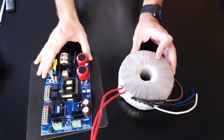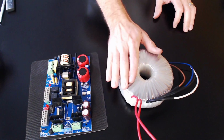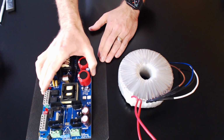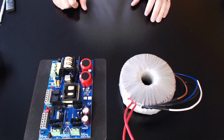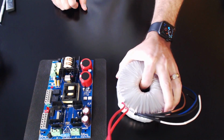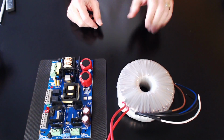that's in there. So what I want to do is give you a little close-up of a linear device and a switching power supply, so you can see the differences between these two products here. This is more of a transformer or a coil, but it's typically included in a linear style power supply like you saw on the slide there previously. But again, very, very heavy. It's probably something that my son is using to work out during the quarantine time and not being at school. It's an extremely heavy device, but like I said, it has a lot of material, and typically it's copper, so it becomes much more expensive.